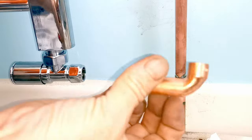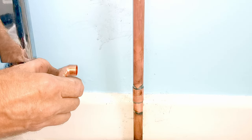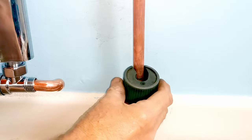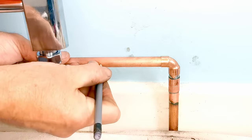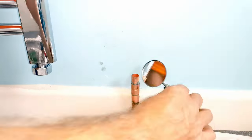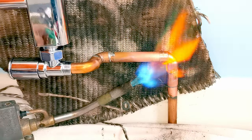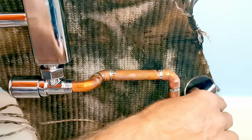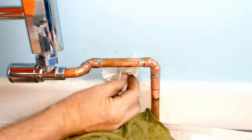I use a long street elbow in the valve and another elbow on the other side. I put a piece of pipe into the radiator valve and draw a line on the other bit of pipe to get the correct height, then use my pipe slice to cut it off. I put an elbow on, add a bit of pipe, then mark the distance to the other elbow, cut it to length, and put it all back together to check it fits. Then I flux it all up, clean any pipes that need it, put it all back together, and solder it up. When soldering I keep the radiator valve open and leave the blanking plugs off the top of the radiator so any expanding air can escape and not blow the solder out of the joints.